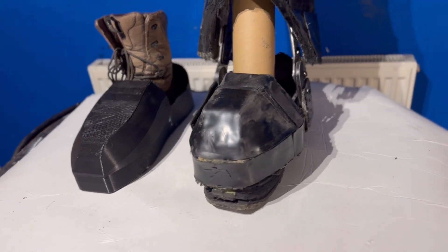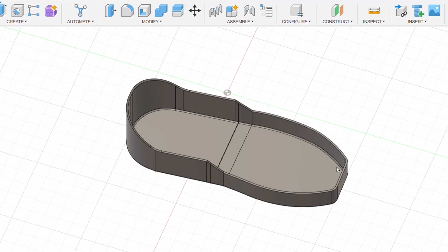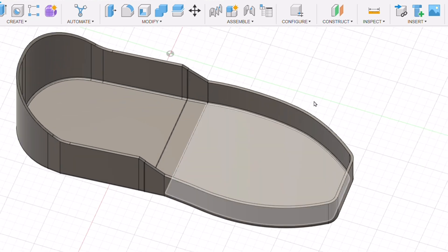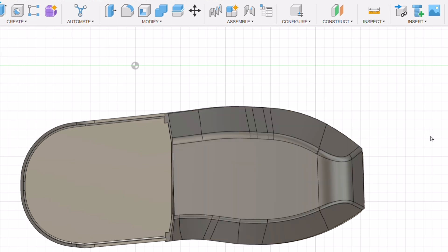Now we'll take a brief look at the old 3D print in Fusion 360 and see what we're modifying. First, we need to peel back this edge to ensure full ankle movement without it clashing with the plate. Then removing the toe piece, I want to knock off around 20 millimeters here and curve it around — keeping the same dimensions for the sides, which seemed right. As for where the ceramic armor is going, I'll lace it around here and down to the toe section. I don't think I'll bother with ceramic in the sides — it's just extra weight for very little benefit.